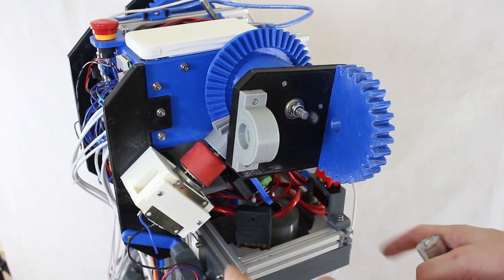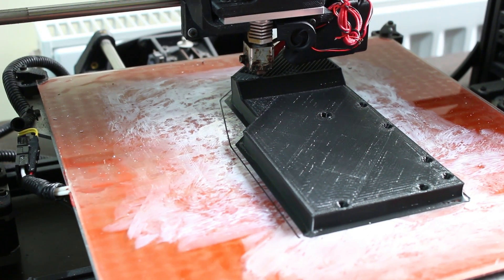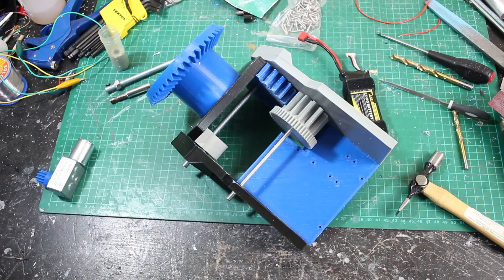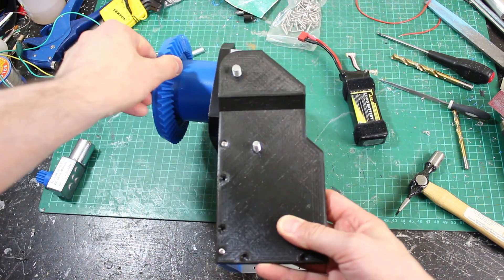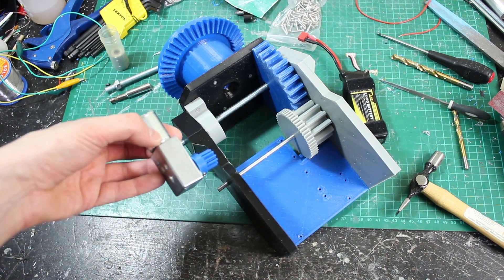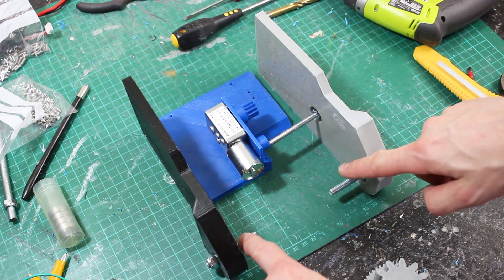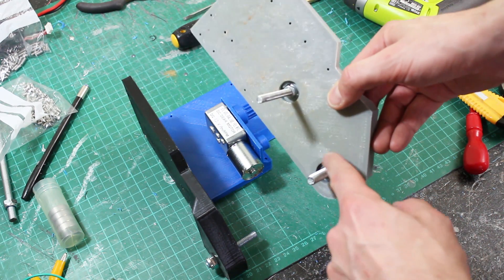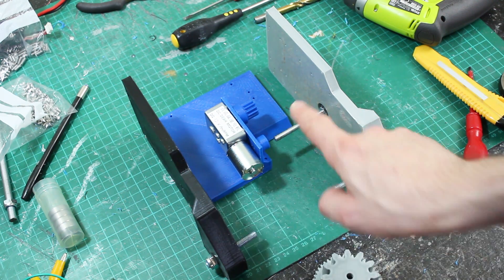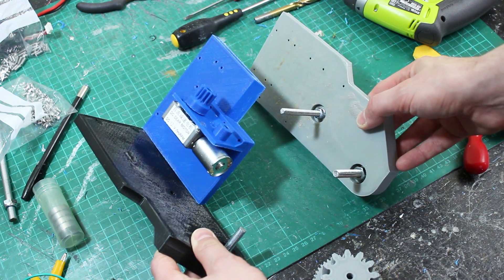We just need to print those side panels so we can mount the intermediate gear and the motor to drive it. Here's that assembly - the bevel gear goes on the arm and you can see the gears moving as I move it. For the pivot points I've bolted shorter bits of studding to each side with a recess in the plastic, so the studding doesn't run all the way through - that's for an important reason. Similarly, the shaft this gear fits on only runs up to where the motor bracket is and doesn't run all the way through, because otherwise the motor wouldn't fit and I wouldn't be using the space efficiently.